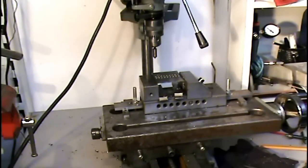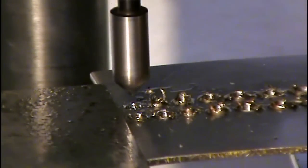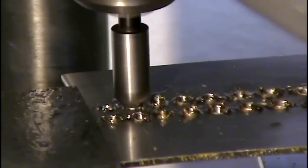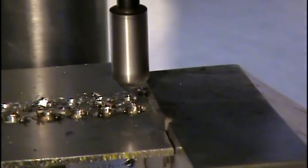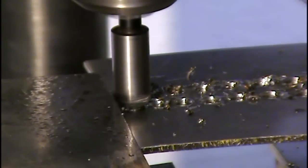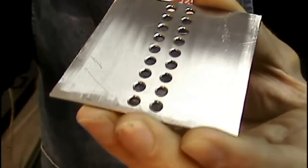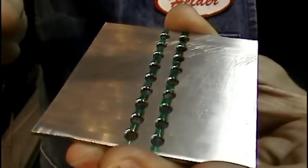There's my small drill press machine all set up to chamfer those four millimeter holes to remove the burrs. I actually have an X and Y cross table mounted on it, and sometimes I use this setup as a milling machine. All done — there's the housing plate ready for bending. After the chamfering I polished it up a little bit with some sandpaper. On the inside with the scriber I made a couple of lines along the holes, and these will be guidelines for the bending.